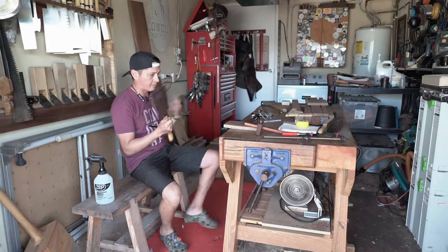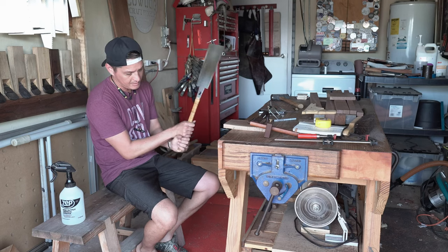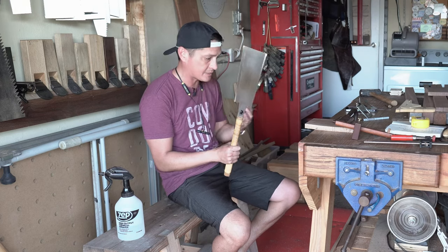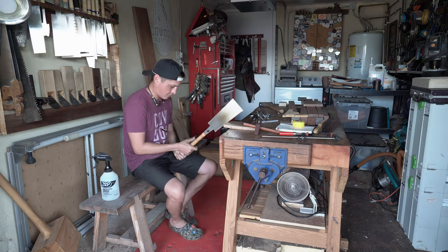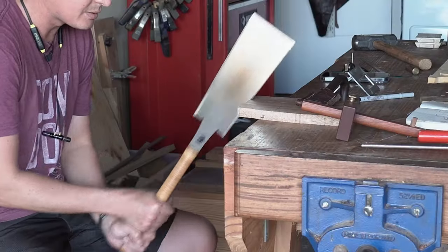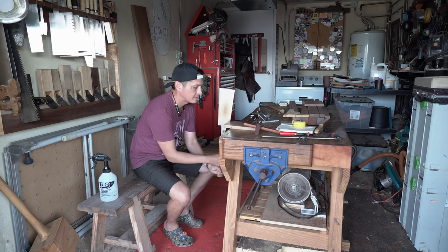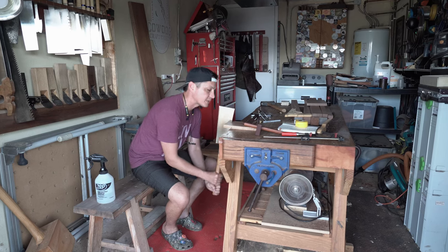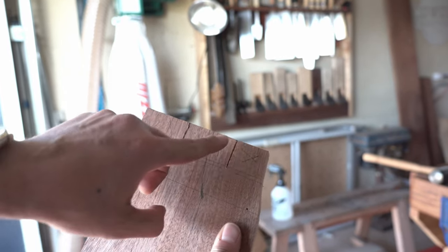You might notice that my grip on my saw is a little different from my prior videos. I learned a couple of techniques from Jan Jager just watching him saw. He would grab his saw and handle it at the bottom — no thumbs involved. What I think that does is create a little less steering as you're trying to make your pull stroke, and it also helps you stay plumb. So once I get it going, I just literally grab with my hands stacked at the bottom, just like that. I'm following the line, and once it's set, the natural tension on the saw allows me to stay really straight and plumb. Another test to see how plumb you're sawing is to flip the board over and see if you're tracking your lines. Here's the backside — I didn't get all the way to my baseline, but you can see that I'm still tracking my layout lines very tightly. This technique is really cool. I wish I had learned it earlier, but hopefully it helps you keep your sawing nice and straight and plumb.